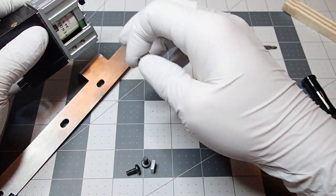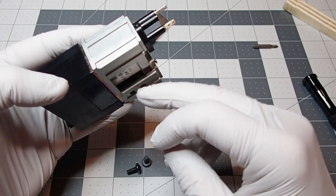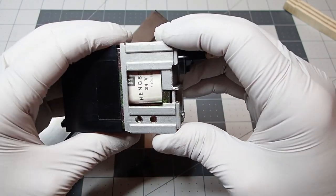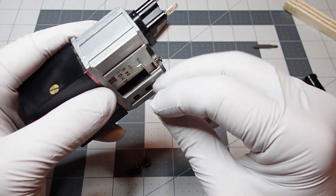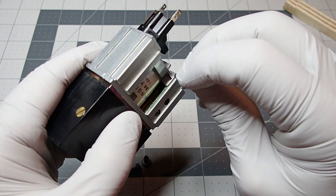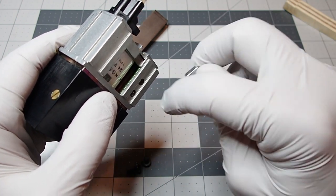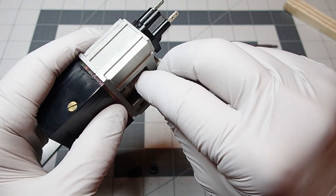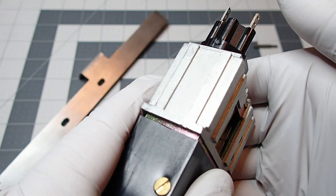And the idea here is that, and hopefully you guys can see this, I needed a way to attach the counter to the rail and wanted to find something simple. I wanted to minimize the use of adhesives and make everything replaceable at the end of the day. So I decided that if I use square nuts, they will self-lock once they're in here, and I'll show you what this does. Basically, if it's square, it sits square at the bottom here and against the other nut, and by screwing down the actual screw, it holds itself in there. So you'll see what I mean here. And these are small enough that you can just slide it in. There you go. You might be able to see it sitting in there.